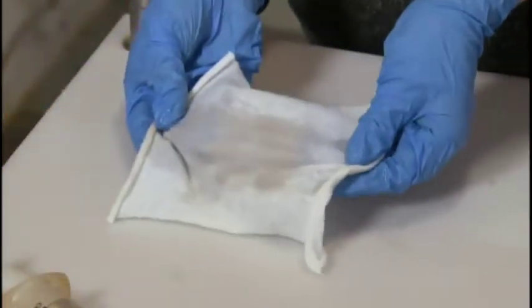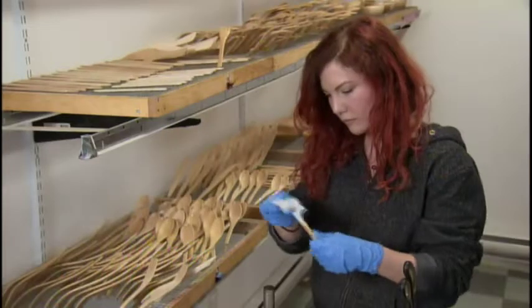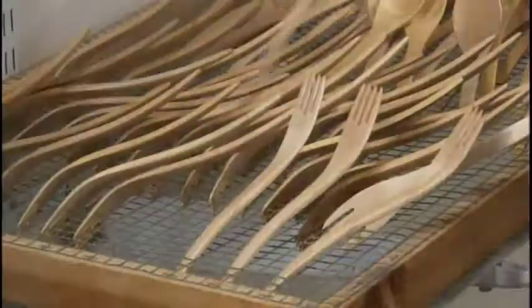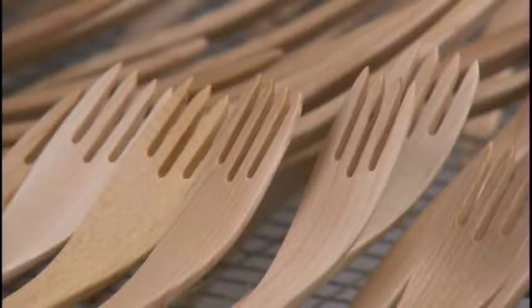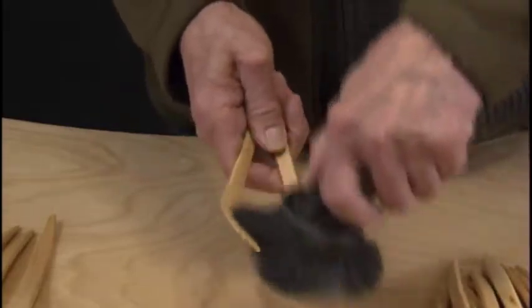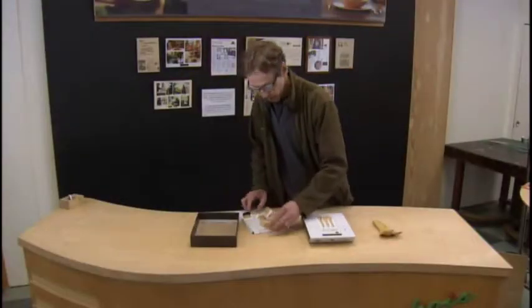The final step is an intricate hand-applied finishing process. Three coats of a proprietary mixture of food-safe plant oils, waxes and lemon. Lemon works like a solvent, diluting the mixture so that it penetrates deep into the pores of the wood. After the last coat dries, a worker manually polishes the surface with an ultra-fine abrasive pad. Sweep off any dust, then let the finish cure for 28 days.